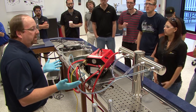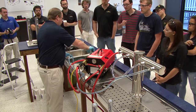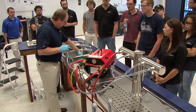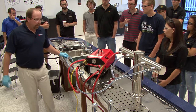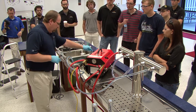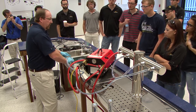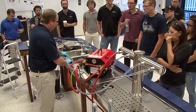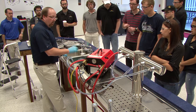Once that 15 minutes is up, basically we would go through the rinse-out procedure. So let's assume that our 15 minutes is up — our timer has gone off. Basically now what we need to do is rinse out that solution with fresh water, just cold water, standard cold water. Once we get enough cold water to cover the suction side of the pump, basically we would let the chemical and the water that we're flushing out go down the drain. As soon as we get enough water in here to begin the flush-out process, then we'll pull the drain on this.